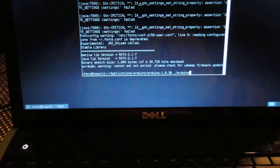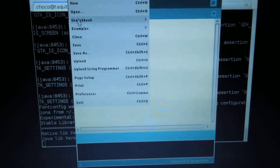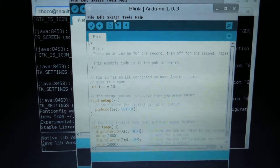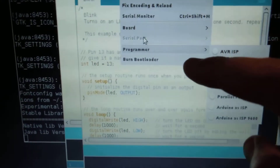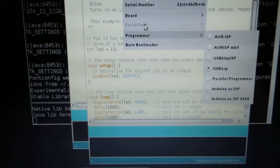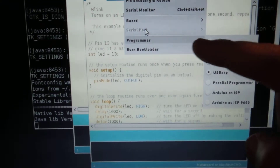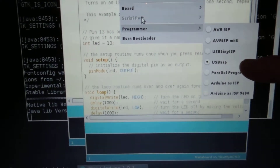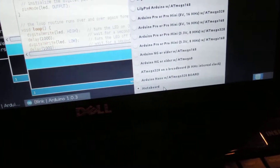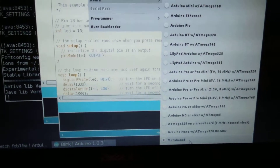I open the Arduino IDE and can now program the device. I'll open the blinking sample sketch. From the Tools menu, you can see the serial port is disabled — unlike a regular Arduino which creates a virtual serial port, in this case we use USBasp as the programmer, which is emulated by the Meta board framework. We select the Meta board board definition I created following the Meta board website instructions.